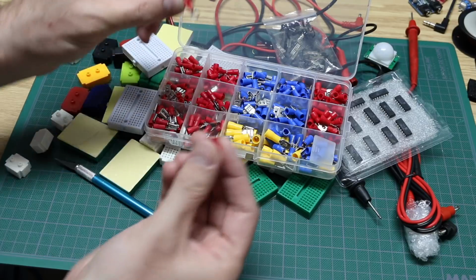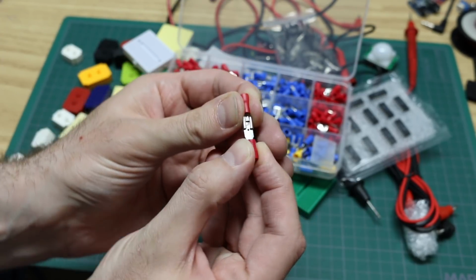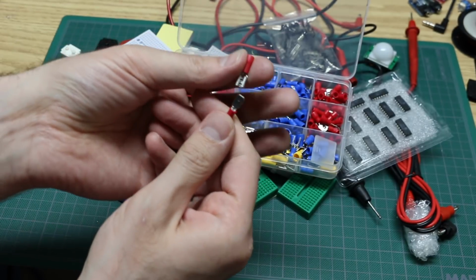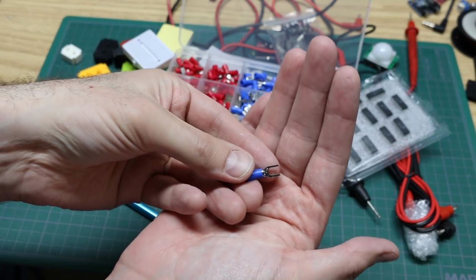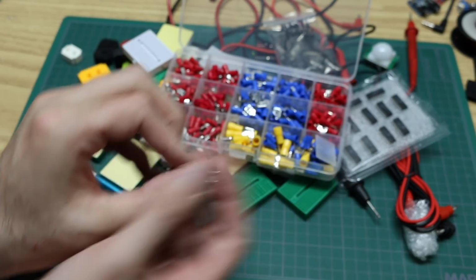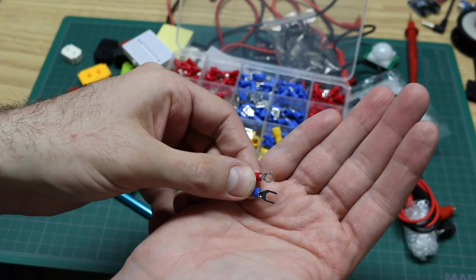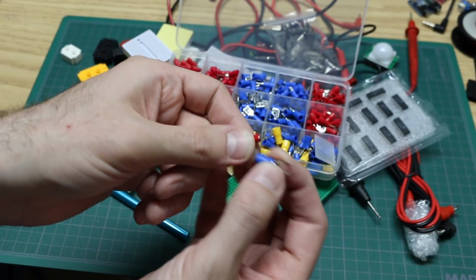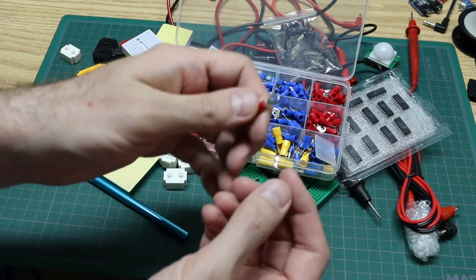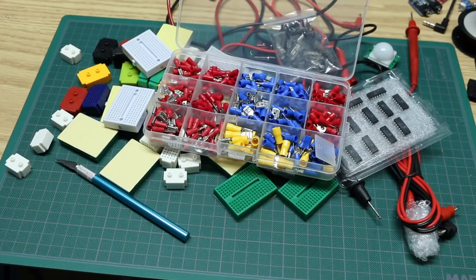So, various sizes and gauges of ring terminals or just straight plugs. Of course, the idea is these will mate together and you would use the proper tool and crimp a wire on here and have removable contacts. So some of them are these forked ones. Depending on what you need to do, mostly I got this kind, the fork, as well as the ring terminal to have around, because sometimes you might have something with a bolt on a chassis and you can't take the bolt fully out for some reason, but you want to loosen it a bit and slip something in there, so that's what this one's for. Other times you want to make sure the bolt will have this on it, so you put the bolt fully through here and there's no way it'll slip out. So good to have around.